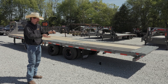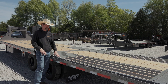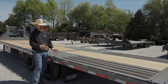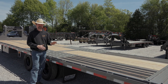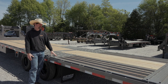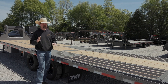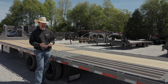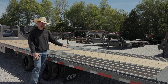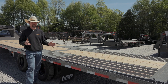It's not going to have any loose movement going down the road from bumps and road shocks. These tails are rated to carry 8,000 pounds — that's true of both Diamond C and Max D — and that's 8,000 pounds evenly spread or centered on the tail. Some manufacturers will rate these tails to lift more than carry. Max D is one of them: they rate their tails to lift 10,000 pounds but to only carry 8,000 pounds. The reason is that the most stress these tails see is while carrying down the highway, where you're constantly seeing shock loads from potholes, bridges, and so on. If you try to load something too heavy — put a skid steer that's too heavy on this tail and try to lift it from the ground — you're most likely not going to bend anything. The pump will just limit out and nothing's going to happen.